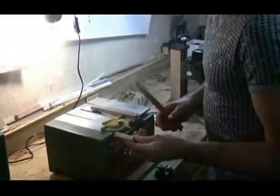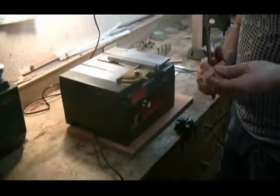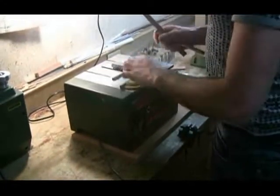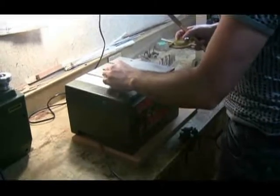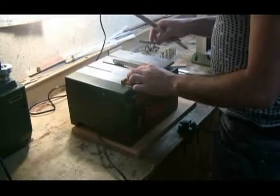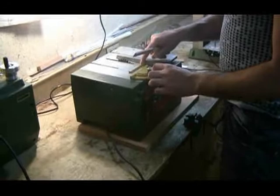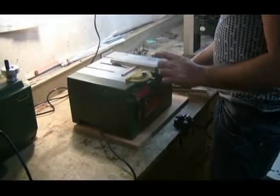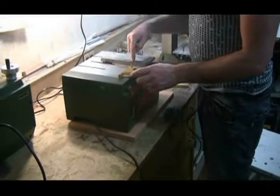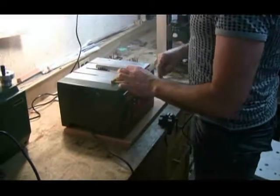Dr. Michael just had to step out for a minute, so I thought I'd take the opportunity to go through the circular saw and some of the rules I've learnt with using it since I've arrived. When you're cutting a piece of wood with a fence like this, repetitive cutting, Dr. Michael has told me to always use the 90 degree gauge to hold it and push the wood, and to also ensure that you've got a 90 degree angle between the saw and the wood. Now, as is the case always, you've got to measure this against a fence and make sure you've actually got a 90 degree angle, because you can't trust the machine. This little measuring device, I mean.